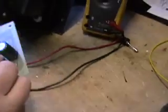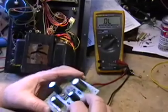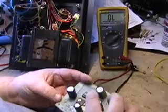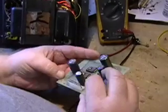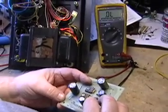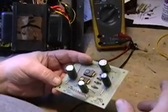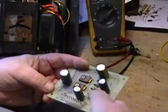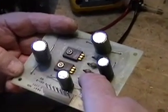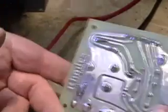So now, this is a 4-diode bridge, and unfortunately this particular diode isn't made anymore. It was made by GE. We're going to replace it with another diode that we have on hand, but we're going to change all 4 of them, and the reason is the forward characteristics of the ones we have are different from the GE ones. So for safety reasons, we're going to change all 4.